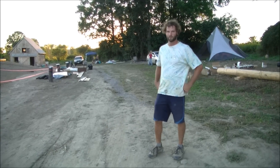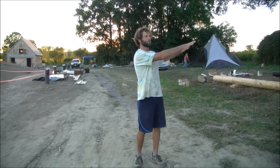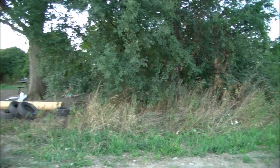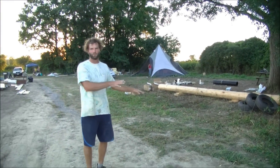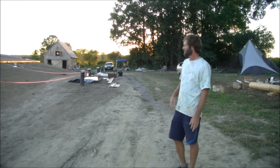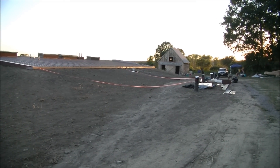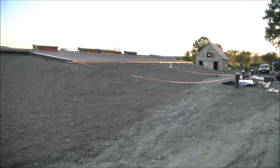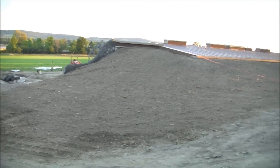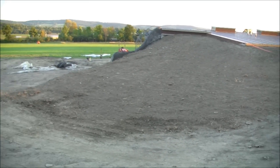Can you tell us a little bit about the drainage situation here? We have a decent slope coming off of that cornfield in the back. In the springtime it gets pretty wet — a lot of runoff coming downhill. The plan is to have the berm kind of usher water this way towards you to the east, and then with the dozer we'll probably carve out a little bit more just to make sure that water would go that way.